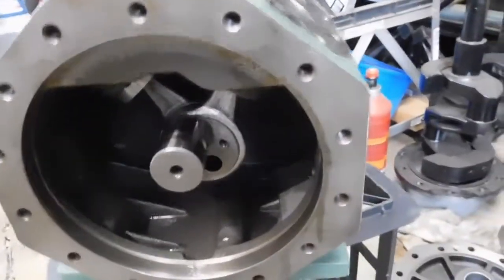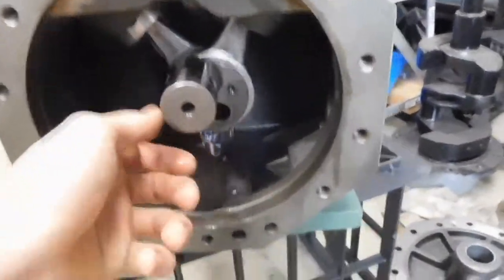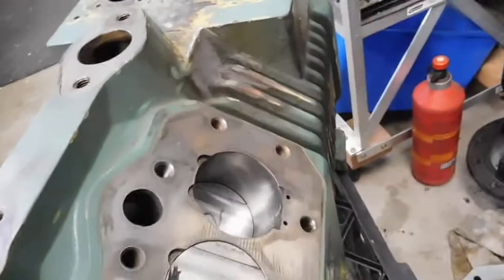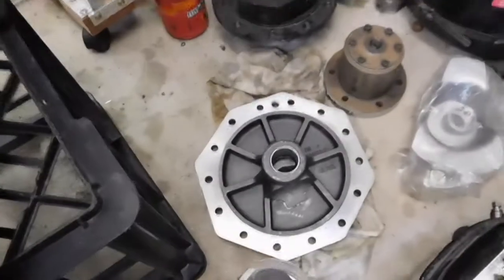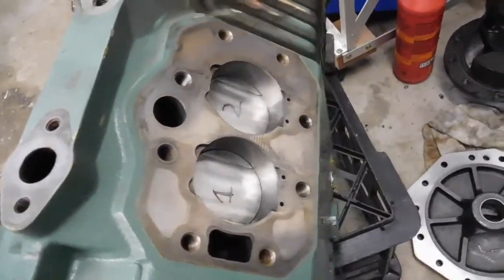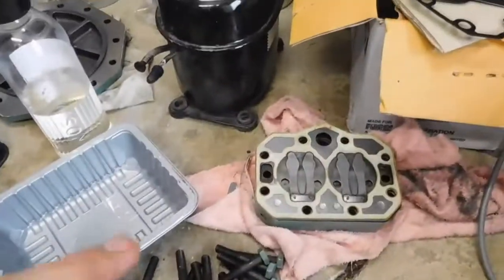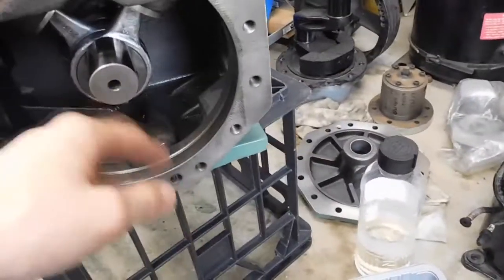It is a little bit of fiddling around to get these in. First, you've got to put all your pistons back in in the same order they came out and in the same orientation. Then just maneuver your crankshaft through the big ends and they go in pretty easily. Despite that worn bearing — it is rubbing a little bit and there's some play in it — it actually turns over really smoothly. Once I get that end housing on plus an external bearing, there shouldn't be any movement on that at all. Hopefully I'll just be able to bypass that completely. Anyway, it's come together slowly, which is good. Next step is to put the heads on, make sure the valves seat properly, then put that oil splasher back on, and then we can put that end plate on with its gasket. I did manage to find the gaskets for this too.